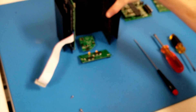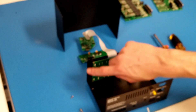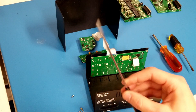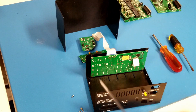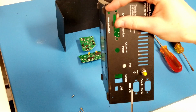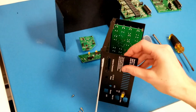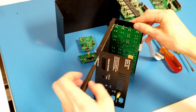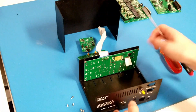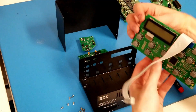Now let's look at the display board. There are four screws holding it in place. This is where the long-handle screwdriver is necessary. If you're just replacing the driver board, any Phillips screwdriver works, but for the display board you definitely need a long-handled one. Two of the screws are only accessible through holes in the back of the controller — there's one hole here and another there. Take the screwdriver and poke it through to unscrew them. With those out, you can take the display board out.